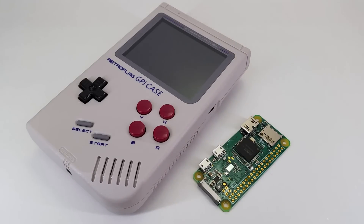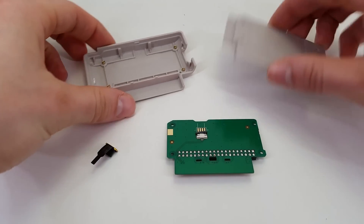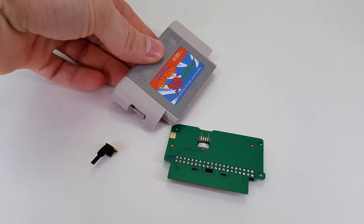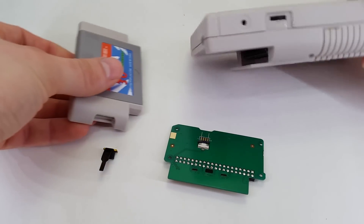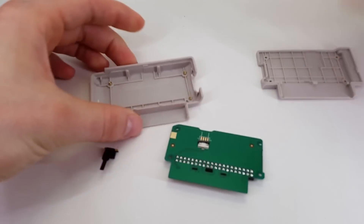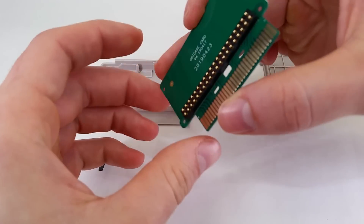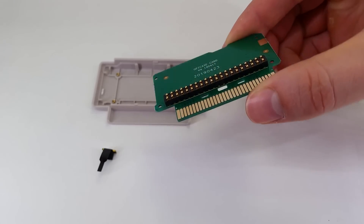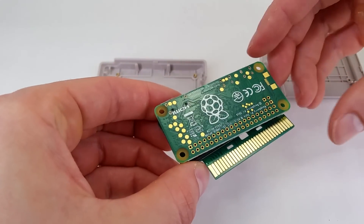Let's talk about how to assemble this thing. You will need a Raspberry Pi Zero, and I'm going to use a Raspberry Pi Zero W primarily because when we put this thing in the pseudo cartridge, we have no access to another HID USB port, so the wireless capabilities really help us load ROMs and so on. The way this case works is you put the Raspberry Pi in this little cartridge and then that cartridge plugs into the back of the GPI case. All the input-output, screen, and data streams from the Raspberry Pi are actually transferred through this edge connector on the cartridge and they're pulled off the Raspberry Pi with these pogo pins, hence the solderless assembly.